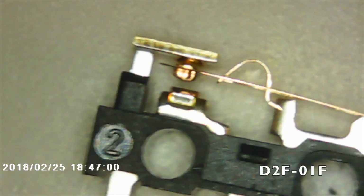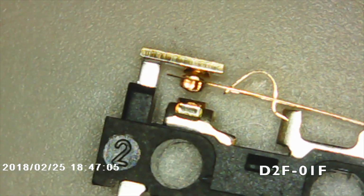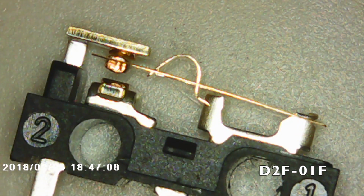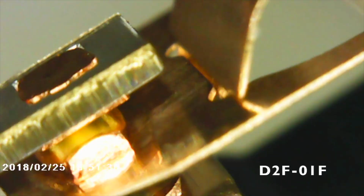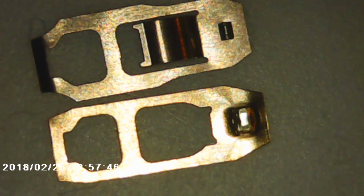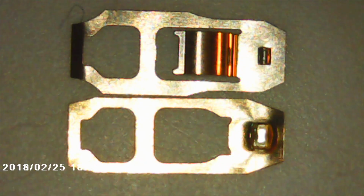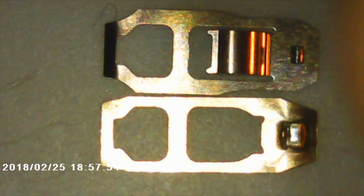And that contrasts with the Japanese Omrons that have a separate rivet that is copper coated with probably a nickel substrate that's coated in gold, and that's for both the part that's on the clacker plate and the rivet that's embedded in the electroplated base plates, with that gold alloy contact hopefully being the same hardness on both the rivet that's on the clacker plate as well as the rivet that's on the stationary contacts. And then it uses a separate spring like you see on the bottom here, as opposed to unifying it as one piece like on the top. And then the bottom compression spring or return spring, whatever you want to call it, is made out of a separate material.